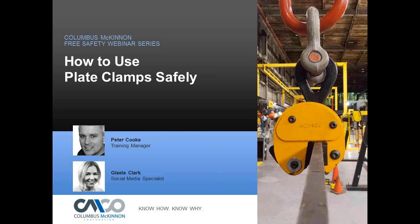In this presentation, you're going to learn how to use plate clamps safely. This webinar will review the safe use and inspection of plate clamps for lifting structural plates and profiles, including how to determine the proper size and type, understanding the mechanics and design of a clamp, and how to inspect and care for clamps.